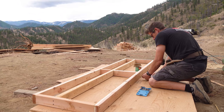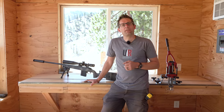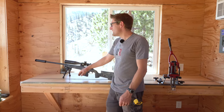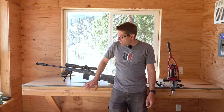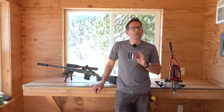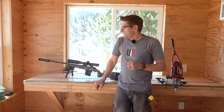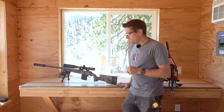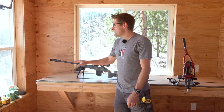For this bench I'm not getting overly precise — I really want to roll with the mountain top outdoors theme and not be an overly perfectionist type. I didn't even use clamps; I just eyeballed stuff and screwed it together. Then you cut down a full-length 2x4 that serves as an attachment point for both the decking and the tracks. The front track, the outward-facing one, goes right into the 2x6 decking and down into the 2x4. The rear one goes through the decking and down into that other full-length member — a 93-inch 2x4 as opposed to the 96-inchers because of the thickness of the 2x4s on either end. Then it's time to mount the frame to the wall, with one transverse member in the middle acting as a stiffening point and maintaining appropriate spacing with all the 2x4s prior to decking.